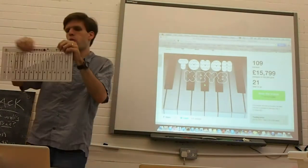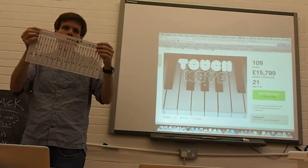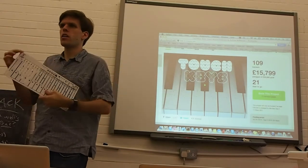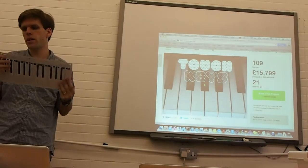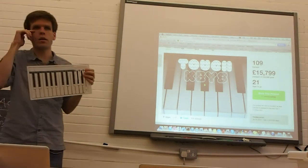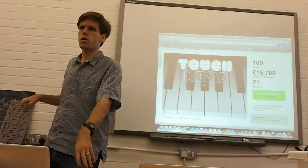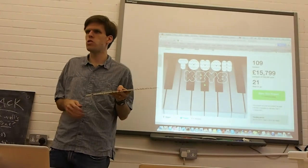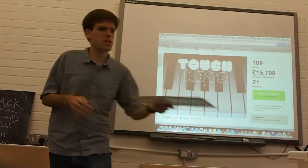And then this board here goes inside the keyboard, and if we have more than two octaves, they daisy chain, and the last one speaks by USB to the computer. Right now it just shows up as a USB serial device, but by the time I ship it, I'm going to make it a USB MIDI device, because that would be a little more compatible with different OSs. It works with Mac, Linux, and Windows. I don't know if anyone's used Juce here, a really awesome cross-platform environment.